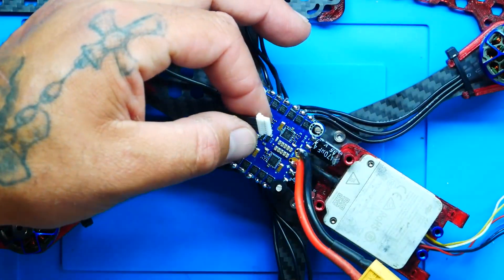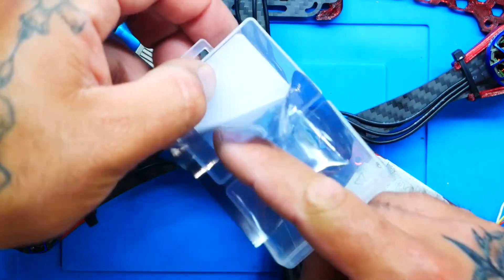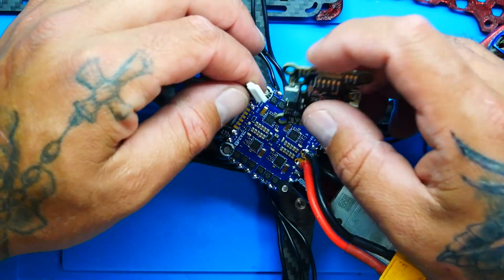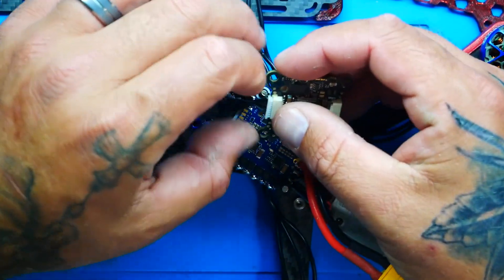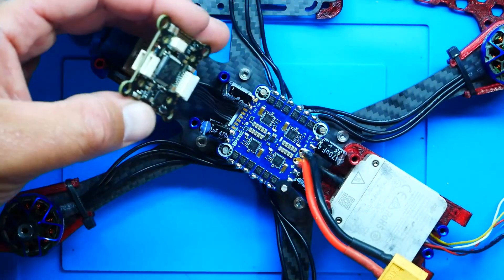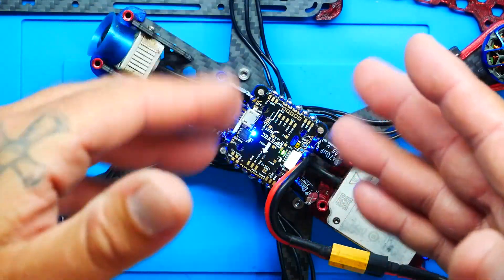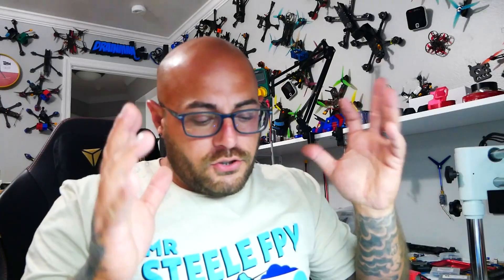What I'm going to do is unplug my flight controller, set it aside, and grab a brand new one right out of the box — a brand new FetTech. I'm going to plug it in. Now if this powers up, that means my ESC is clearly not the problem. All I did was plug in a new flight controller and power it up, and everything is now on and working. I've got LEDs all over my flight controller. That means my original flight controller is toast.